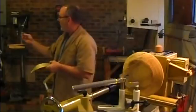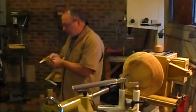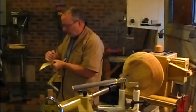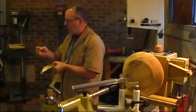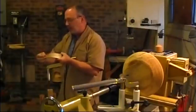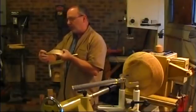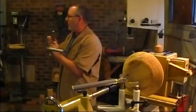You can look at it and see that the primary cutting edge on this is really these 2 little wings here on each side. So it provides a kerf that looks like about 3/8 of an inch, whereas the bar here is about 1/4 of an inch.